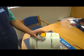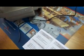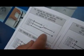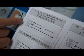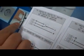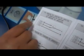Now we are going to connect a TD800-200, which is the S&P inline ducting fan. You will notice that in the booklet and on the back cover there is a wiring diagram for this fan. On the wiring diagram they illustrate the fan with a toggle switch which toggles between the high speed and the low speed. Very important: when connecting the fan directly with electricity, you only use one speed at a time.